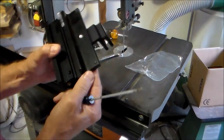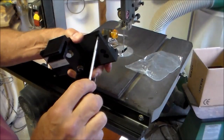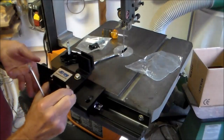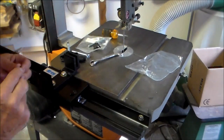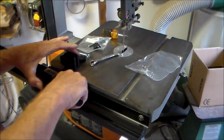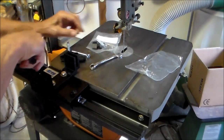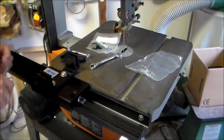Okay, when these are placed in there, you need just a tad coming up, maybe a 1/16 of an inch. And what that will do is remove some of the friction that rubs on there. Now the next thing is, these are also nylon. These will go on this side, and it'll give also a low friction gliding action to the back side of the block.